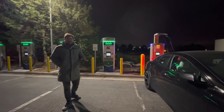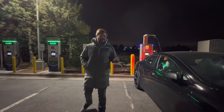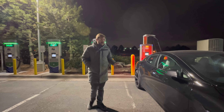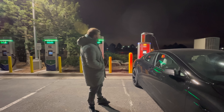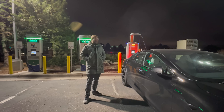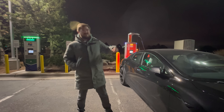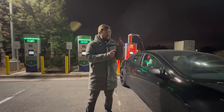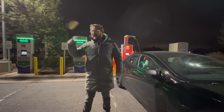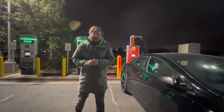The thing ChargePoint does better than anyone bar none is the back-end software. They have the best activation system — you tap your card and go, although it didn't work just then — the best analytics on the back end, and the best pricing structure. You can set different pricing for time of day. An increasing battle for ChargePoint operators is demand charges. You can actually limit the entire maximum site output with their back-end software — for example, say during 3 PM to 7 PM in the summer don't go above 700 kilowatt output for the site — and it can dynamically shave your peaks. Really smart stuff.